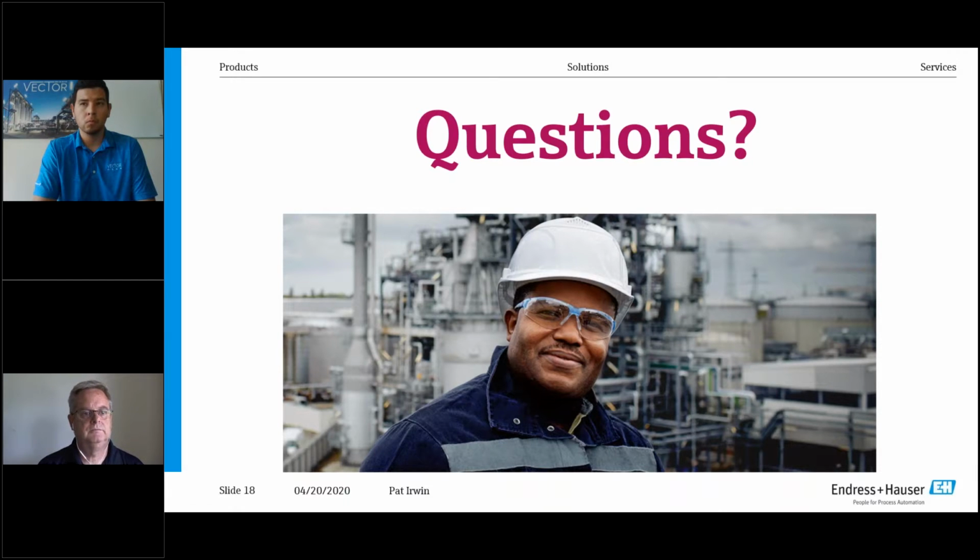And next question, you mentioned the transmitter is the best of both worlds. Is there a drawback to the new technology? No, not really, because the silicon substrate really is the advancement in the sensor portion. The Wheatstone Bridge launched back in 1968 when the capacitance did. There were two manufacturers that led the market with it at the time. So that is very reliable, and that's why we didn't want to really change that.